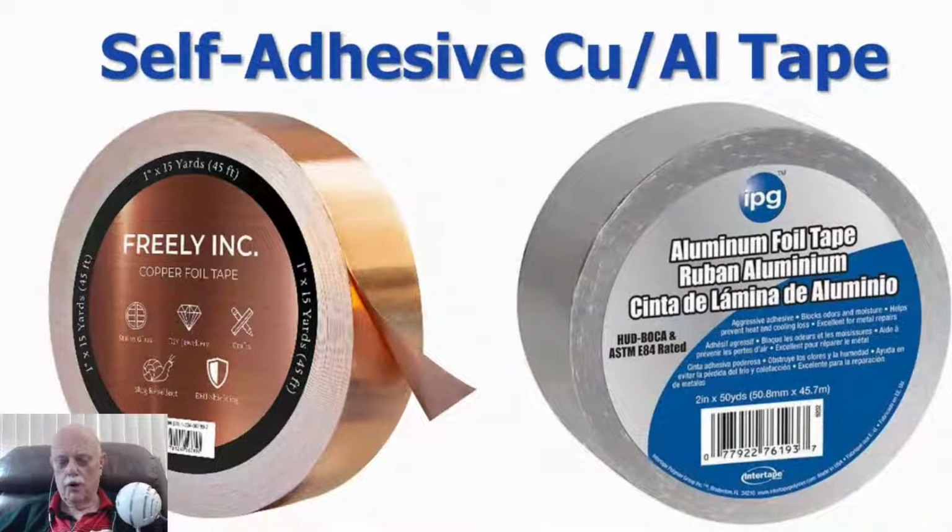This is copper foil tape on the left that you can buy on the internet readily or get at your local garden store to keep snails out of your planters, or aluminum adhesive tape, which you can buy at almost any hardware store. It's used for taping up air conditioning ducts, and it's available readily on the internet in all sorts of thicknesses and widths at quite a reasonable price. It is a great material for building antennas.